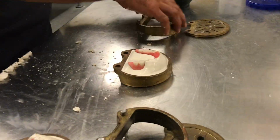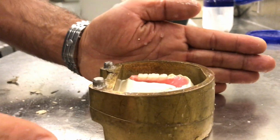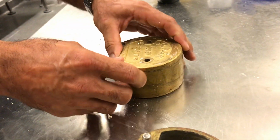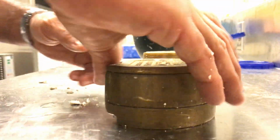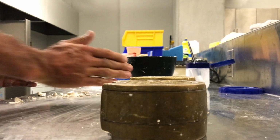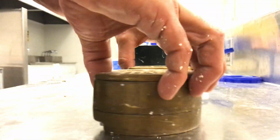Once again, you can verify that you have adequate height for the other upper flask. You can see here there's enough height that the teeth are well below the height of the flask. The lid clearly closes, as well as this one, although this one we came pretty close, I would say, but nevertheless, there's enough height on the upper half of the flask for the lid to close. So on the next video, we'll do the second half of the investment, and there's a couple more videos to come to that.